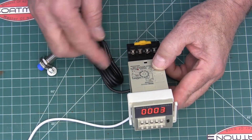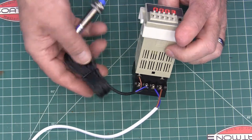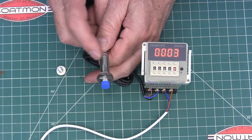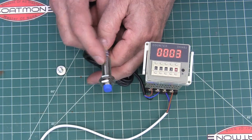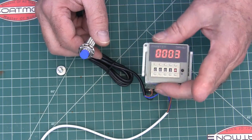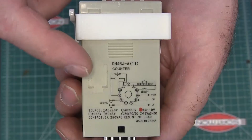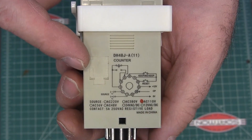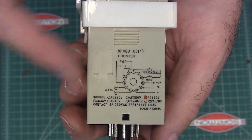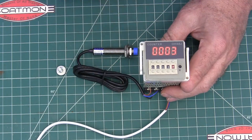I'll put a schematic on the website that shows you how to wire in this proximity sensor. The proximity sensor needs to be an NPN type — you'll see them labeled as PNP or NPN, and you need an NPN for this particular relay. I'll have a link to this in the description in case you're interested, along with the proximity sensors. Here's the wiring diagram. It also comes in many different voltages — this one's 110, but it comes in both AC and DC. Anyway, I hope this was interesting to you. Thank you for watching.